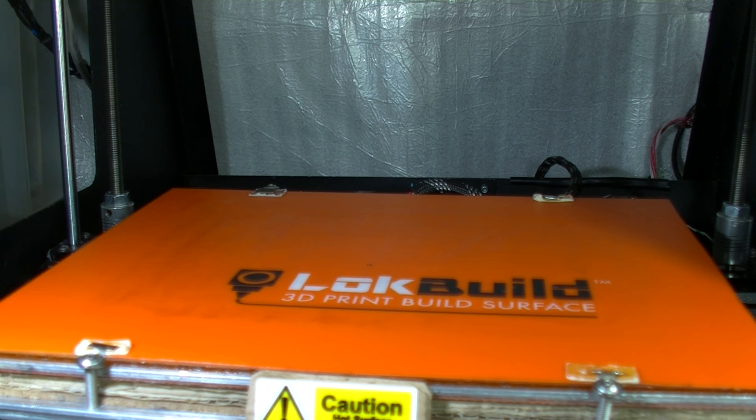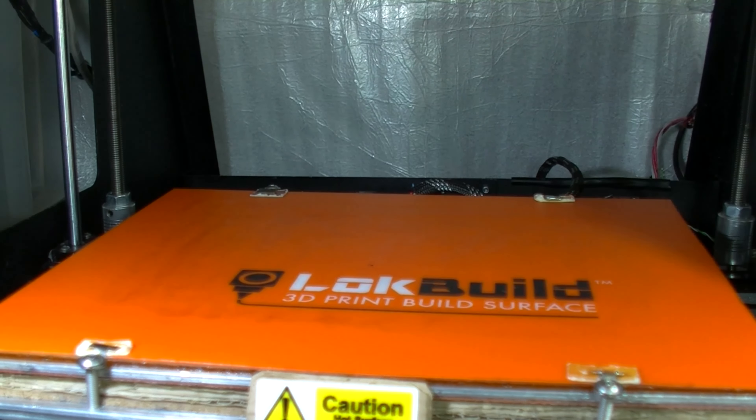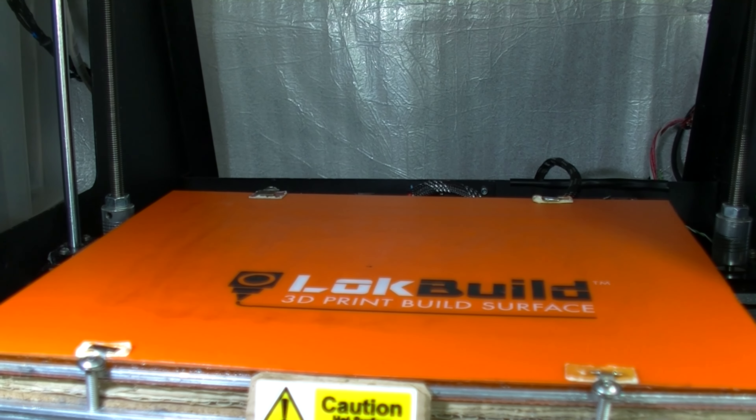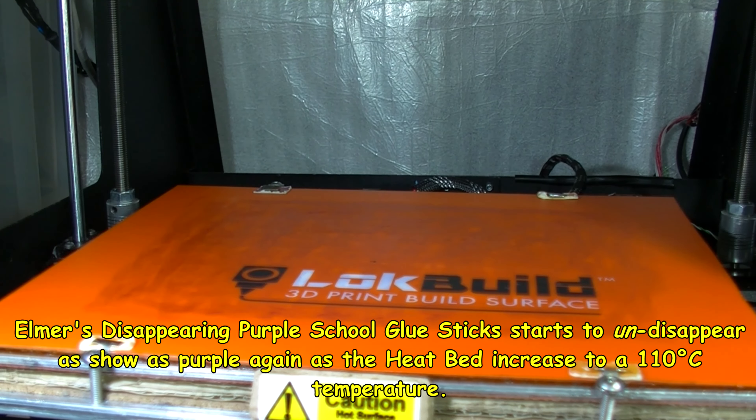I would say I've got a reasonable amount of experience. I have had problems with this printer before — lots of curling and such like. Anyway, the bed's heating up now. I'll come back when it's about starting to print, because it has to go through leveling and auto leveling, warming the bed up and the nozzle etc. That's about a quarter of an hour almost. The bed's on 87 at the moment, gradually increasing to 110.